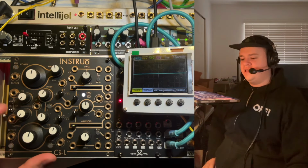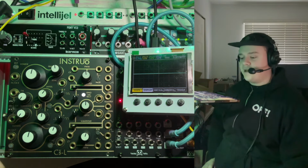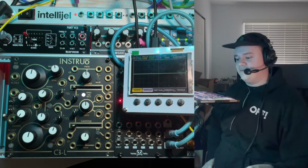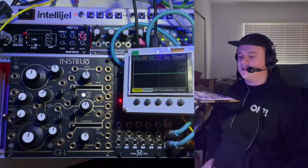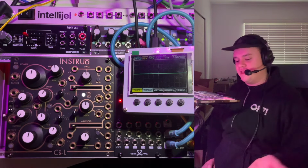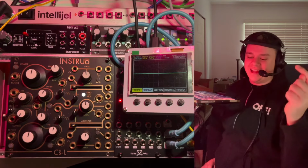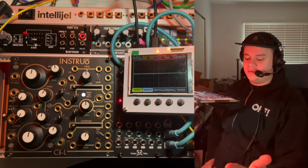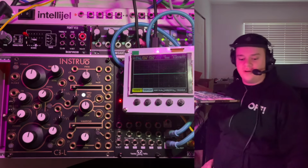Because the sawtooth one sounds better, I'd like to reserve the bottom oscillator for modulation duties, right? That's my modulator. If my sawtooth one could be the carrier because it sounds better, well, then I would want LFO control for the triangle core, and I would want the sub-octave output on the sawtooth core, if that makes sense.